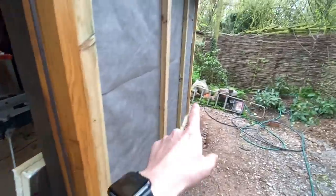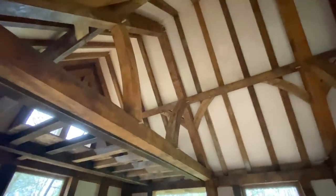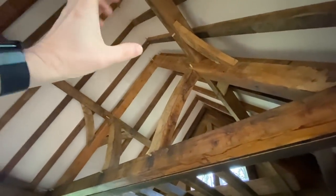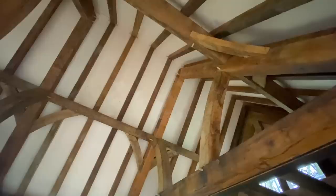So in terms of lighting, what I'm going to do is put the Lutron controls in that enclosure as well, and then run individual cables out from there to each individual set of lights, as there's only five, so it's only five lighting cables that I need to run in. But getting the cables up to there is going to be quite tricky. What we're going to have to do is run above and then drill down, and then I'm probably going to put a metal conduit loop in box just to terminate the armoured cable into and contain the connections, and then the light fitting itself will hang down from there.